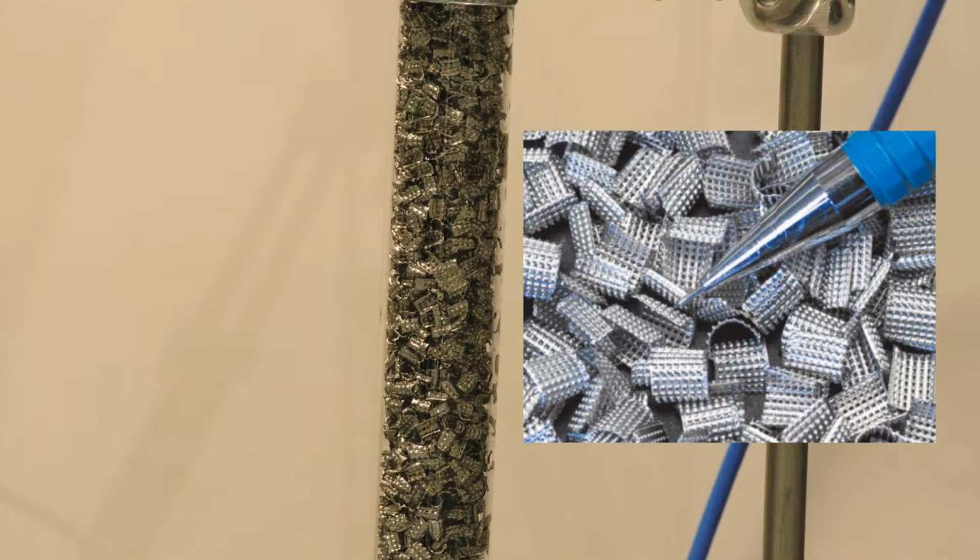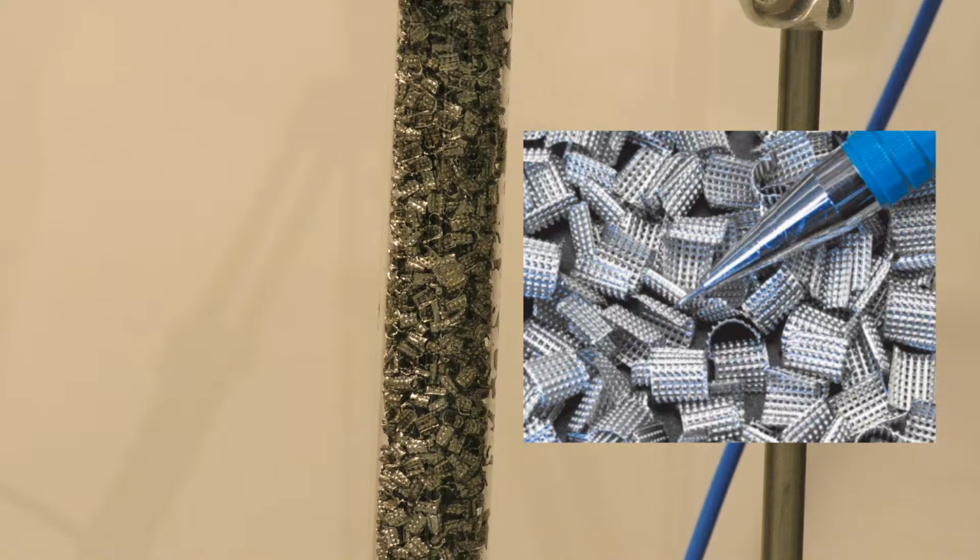Now, if you look at the middle of the column, we have a metal packing called ProPack filling up the absorption column to facilitate the absorption process. This is 0.16-inch ProPack packing, which is half cylinder in shape with two corner bends outwards. It provides a large surface area, which is approximately 1,900 square meter per cubic meter, for interfacial mass transfer during absorption.